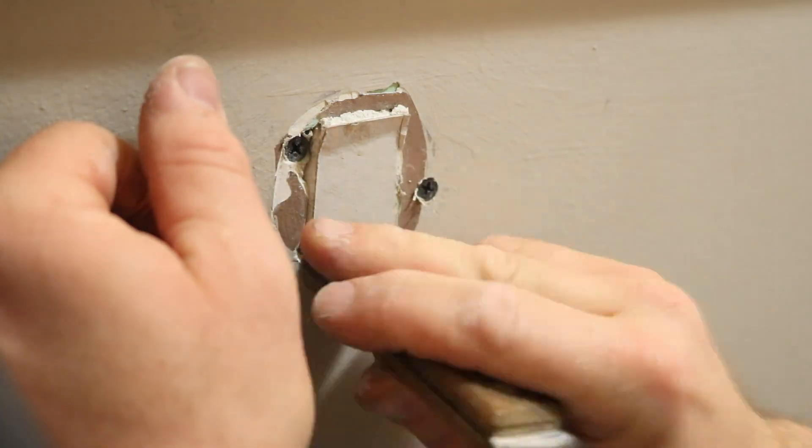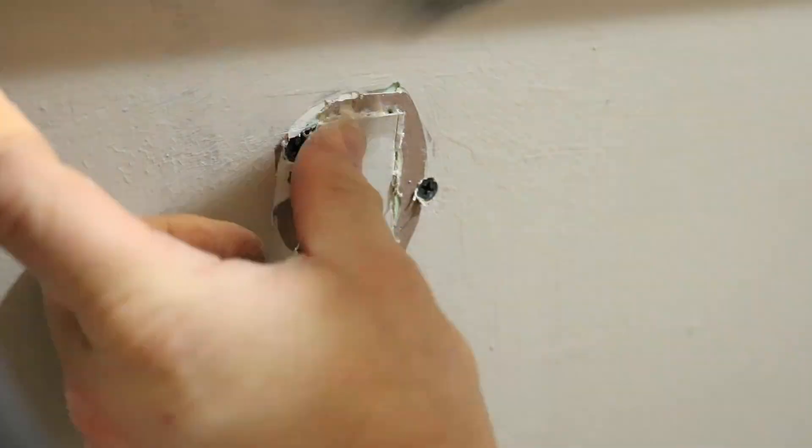For larger holes, or if you put a ding in the wall, or you've got anchors that pulled out and left a gaping hole, you're going to need some putty. I keep some of this general all-purpose putty in the house. If you get nicks in the walls and need to make a little patch repair, sometimes you can get away with just putting some of this on there. If it's too deep, you might need a little piece of drywall. You can buy some patches from the store along with some cheap plastic knives, so you have a little drywall repair kit in your house.